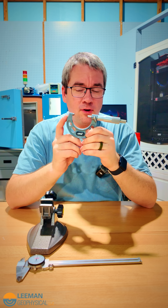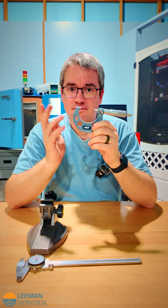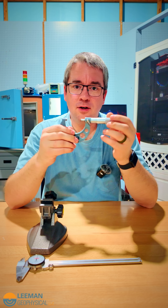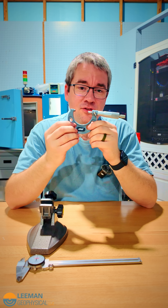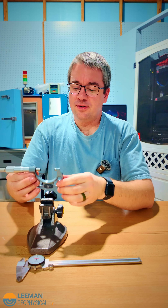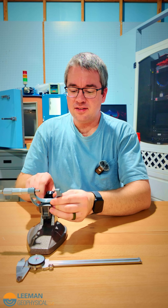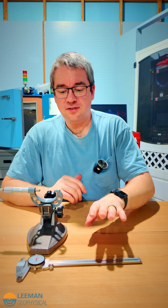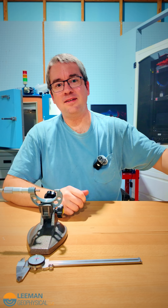So why do you want a micrometer instead of a caliper? Well, these are significantly more accurate. These are good to the tenths of a thousandth of an inch pretty routinely. Now there is a lot of technique in that. Some of them have these ratcheting thimbles to help you get consistent pressure on what you're measuring every time, and they're so sensitive that holding them like I am can heat them and affect the reading. So if we're doing something really sensitive, you try to minimize the time you're holding it, or you clamp it in a micrometer stand and bring the part in to inspect it. All of these tools come in a wide variety of sizes, but the caliper covers the most ground with one instrument that you can easily carry, because once you get into big micrometers they get a little bit absurd to try to carry a set around.